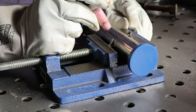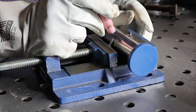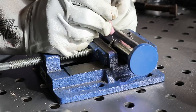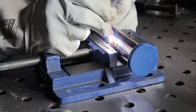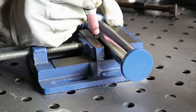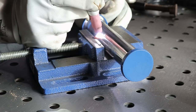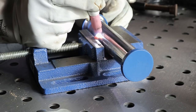This is a DC TIG. I have it set at 50 amps and I'm just working the heat into the screw end until it gets molten close enough to the tube, and then I direct the heat a little bit closer to the tube and that melts and then it joins together. I figured out that to get the right spacing I can tap the tungsten directly to the part that I'm welding and then lift a little bit before starting with the high frequency start — that high frequency start is that arcing that you see at the very beginning.